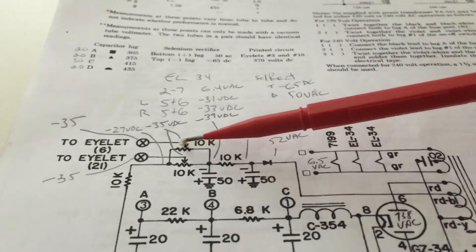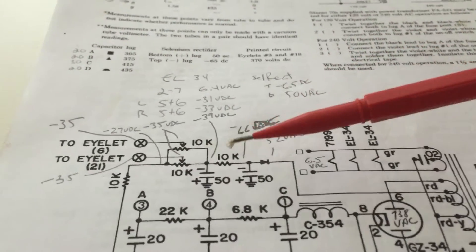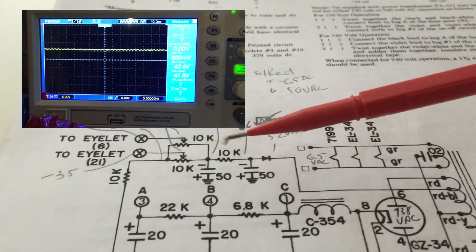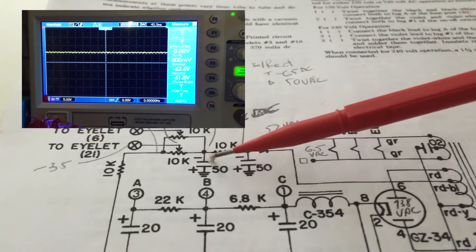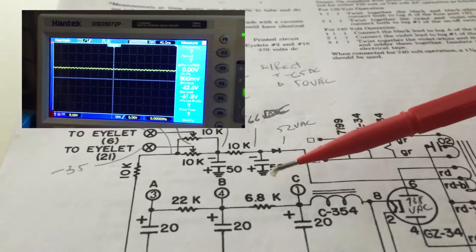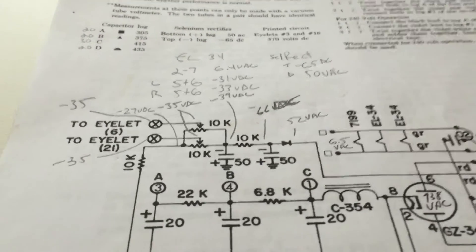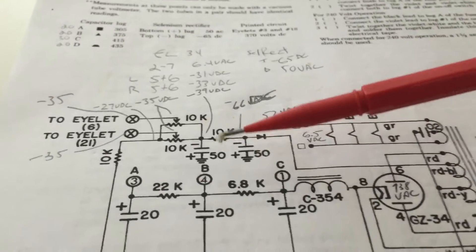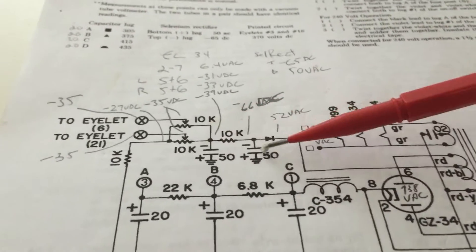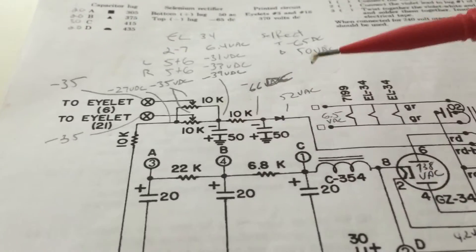Right after here are two potentiometers that adjust the grid bias voltage anyway. We've shown in a previous video how my air conditioner turning on and off with the 50s in place showed a ripple as the voltage dropped and then increased and stabilized. The second time with the newer capacitors — not only twice the capacitance but also better quality and much newer — reduced that ripple substantially. This is all about stabilization and filtering the DC to remove the ripple from it.